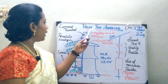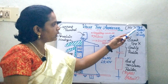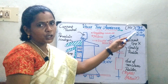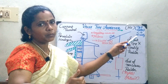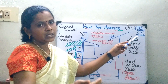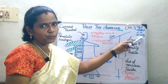Now we will move on to the valve type arrester, which is used for high voltages. It mainly gives protection for transformers and cables. The time of operation is very less — less than 1 second. The impulse ratio, which is the ratio of the breakdown during power frequency and after the surge gets over, lies in the range of unity.